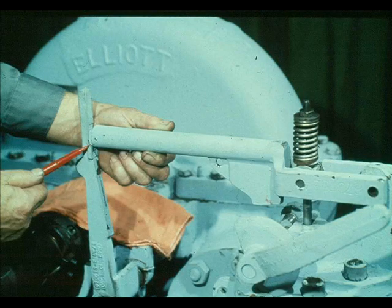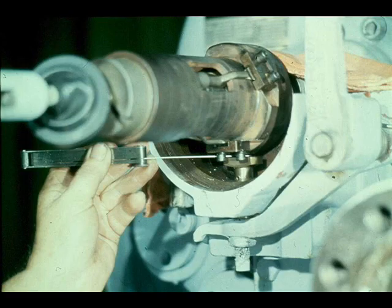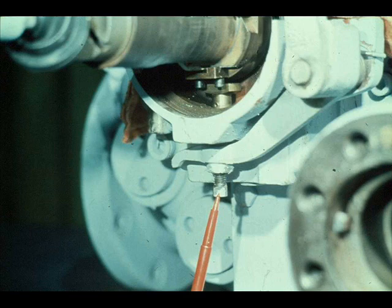After you feel the resistance, continue raising the resetting lever until the knife edges of the resetting lever and the hand trip lever latch. Check to be sure the knife edges are engaged properly. Next, turn the shaft until the weighted end of the trip pin is positioned directly over the trip plunger. Then measure the gap between the pin and the plunger. The clearance should be about 1/16th of an inch. If the gap is not correct, you can adjust the position of the plunger with the jack screw in the end of the hand trip lever.